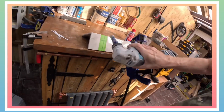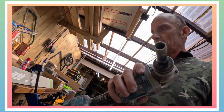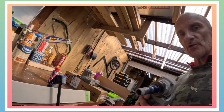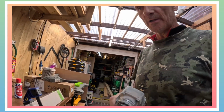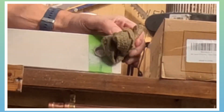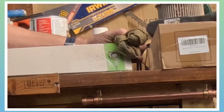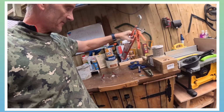Now I'm gonna put this on. This is 18mm. And drill through the marked holes in through the porcelain. This is porcelain, softish porcelain, cheap, but so hold tight. So I'm using a diamond bit and a wet chamois to keep the drill bit cool. This is porcelain, so it's quite hard, and this just helps prolong the life of the drill bit.